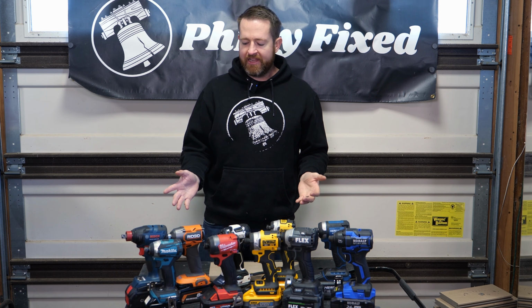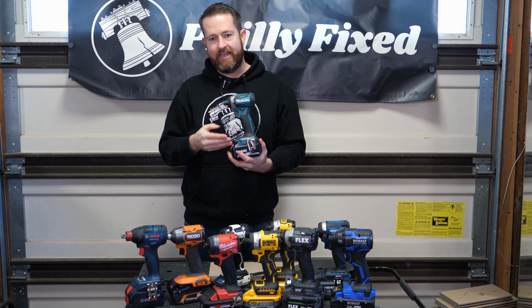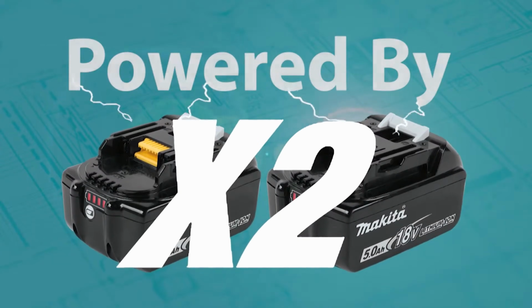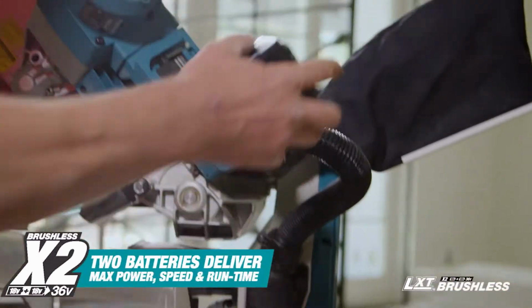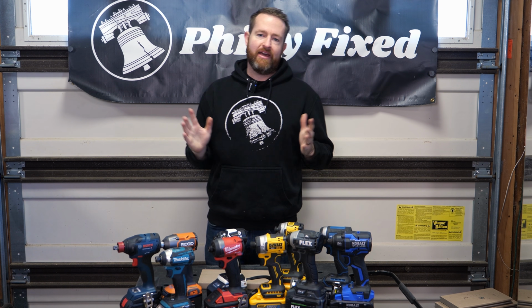For everybody else that doesn't have stacked lithium pouch cell batteries, I used an 8 amp hour 21700 cell battery, with the exception, of course, being Makita, because as you know, the LXT line, they're locked into their 18650 batteries because on their 36 volt tools that take 2 packs, you wouldn't be able to fit 21700 cell batteries in there.